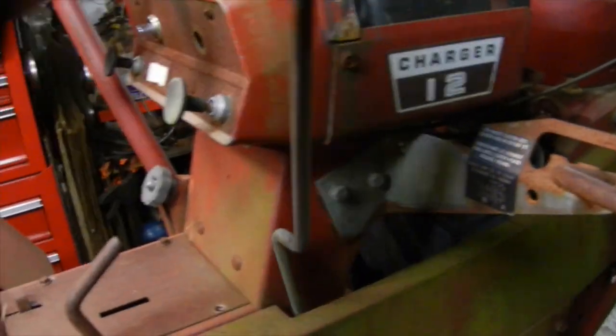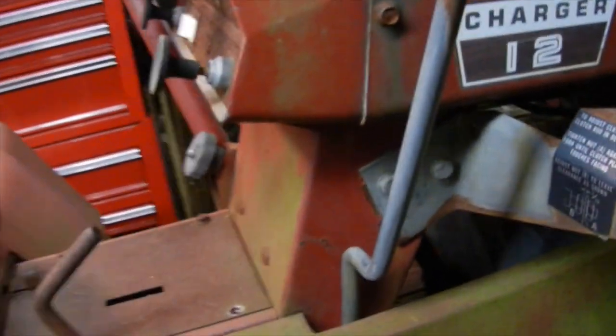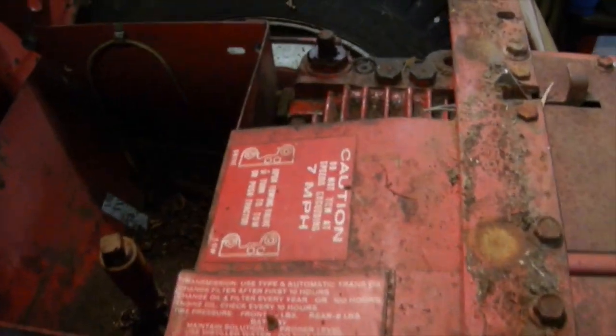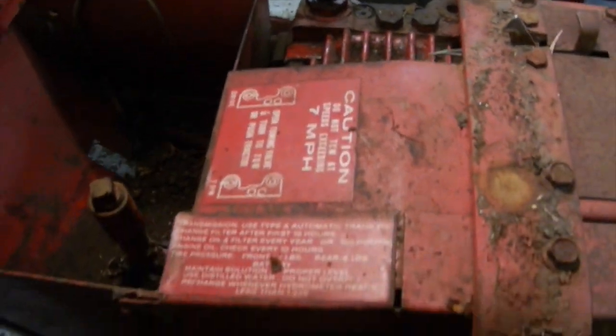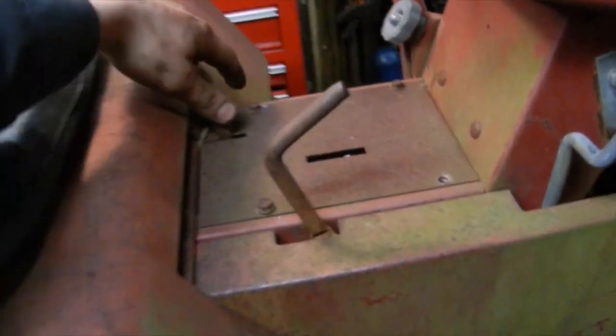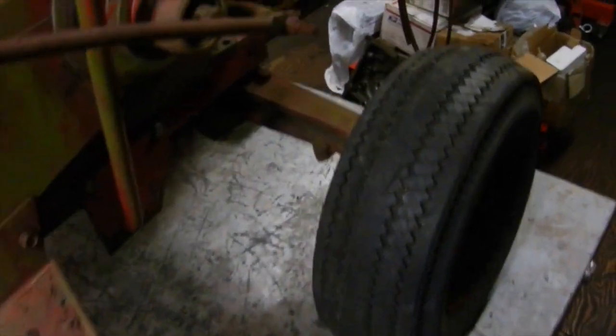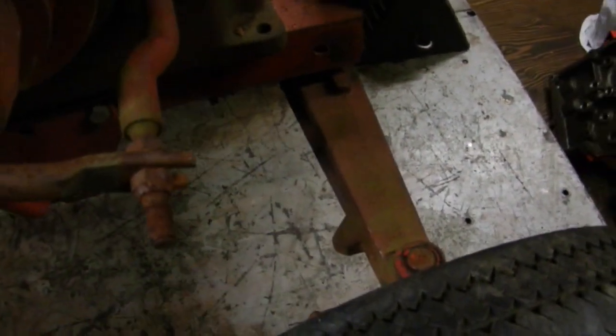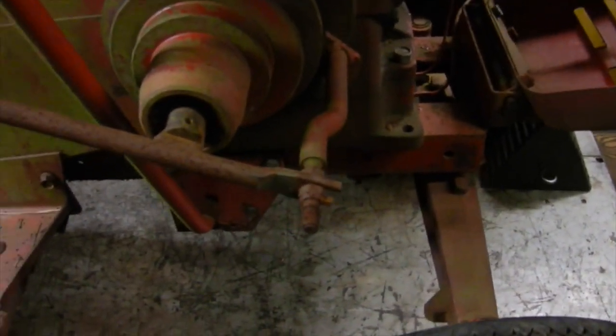The hydrostatic levers all move, though everything needs to be oiled up. It has a toolbox underneath. The transmission does have fluid in it and it's not too bad — it's a little dark but still a little bit red, which is always good. It needs tie rods in the front because they're broken, and one is actually missing on this side. I do have tie rod ends if I have to make them, and I might actually have some extra Wheel Horse tie rods up in the shed also.